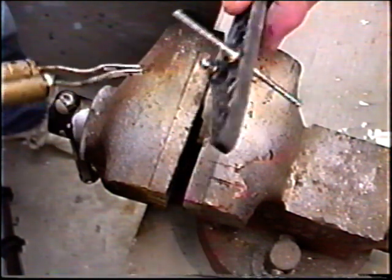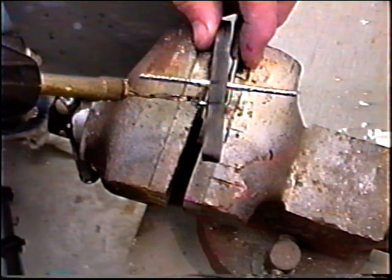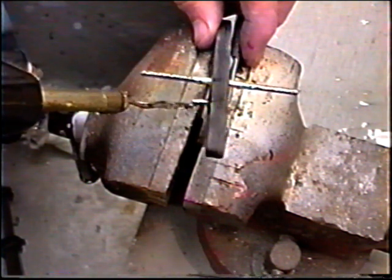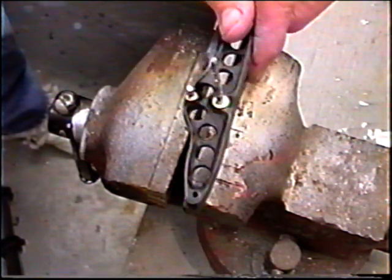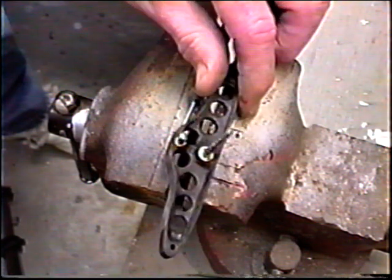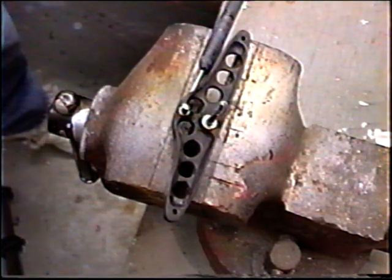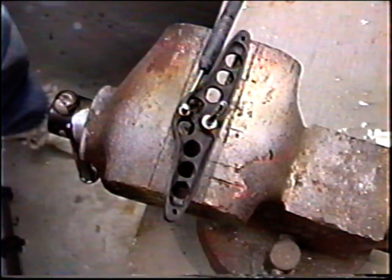The way you can usually tell if you have a really good soldering joint, it'll be shiny when it dries. Stay Bright solder and flux melts at a much lower temperature than regular solder, so it's the ideal choice for soldering around plastic or bushings or whatever.